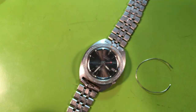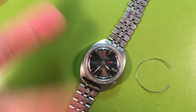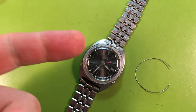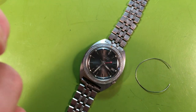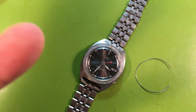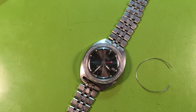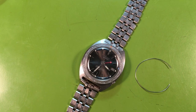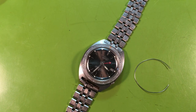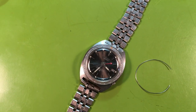It's great that you're investing in it — I applaud you for that. It needs servicing, it needs seals, it's going to need a new crystal, and at a minimum a cannon pinion — potentially cannon pinion and center wheel, plus lower mainspring arbor port repair. But that's the long and short of it — that should really do it. Nice watch, nice watch. Thank you for sending it in, and wave hello to the Beverly depot for me. Bye-bye.